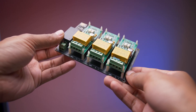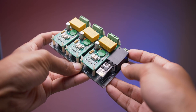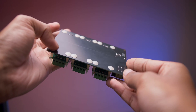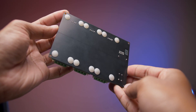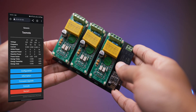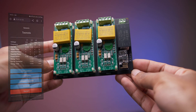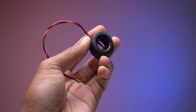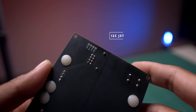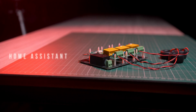Hello YouTube, Steve here. In this video I'm going to show how I built this three-phase AC power meter version 1.2 using ESP01 and PZEM004T version 3 AC power monitoring module. I have used Tasmota firmware for this. These can measure a three-phase current of 100 amps using 100A CT and voltage up to 260 volt AC. I have also left an I2C port so you can add a display or any I2C device.